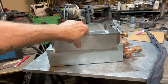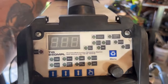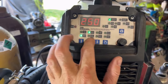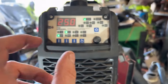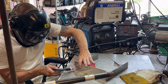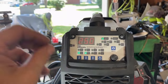So that's my shroud there — stainless steel. A lot of people are looking for instructions for this machine online and there aren't any. Essentially, when you're using the cold welder mode, there are two settings. First of all, you want to make sure you're set to cold weld. The spot mode means when you hit the trigger it's just going to give you one pulse and that's it. The cold pulse is going to give you a continuous pulse after you hit the trigger until you hit the trigger again.